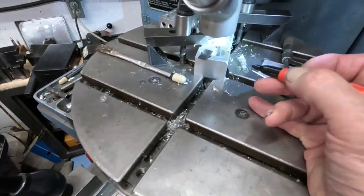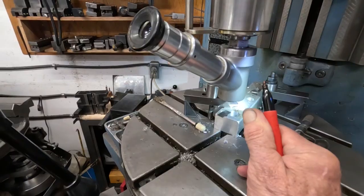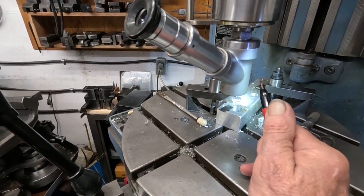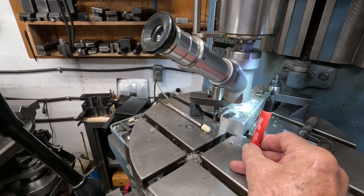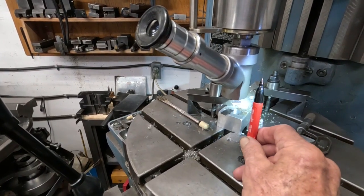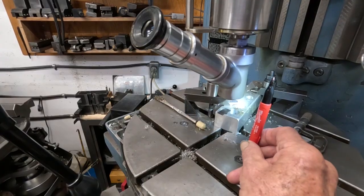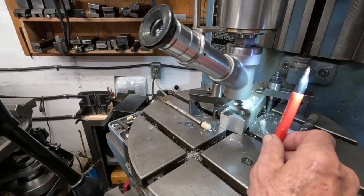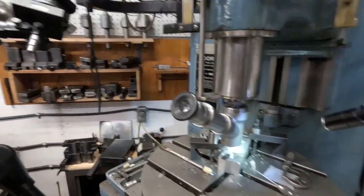My experience with this: you can count on plus or minus two ten-thousandths, but if you're very careful and you've got good edges and dots, you can do plus or minus one ten-thousandth — non-contact measuring with this optical center finder. I used one of these on a Hauser jig borer, a small one with Morse taper 2, and on that kind of taper it returned to zero all the time. The problems you're going to have are trying to hold these in a collet — unfortunately R8 tapers, kind of like 5C, just aren't accurate enough for something like this.